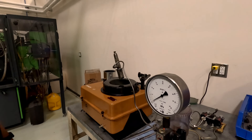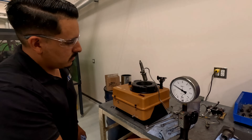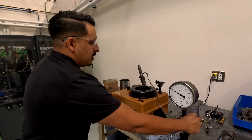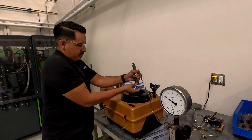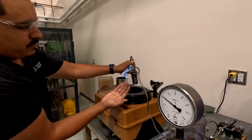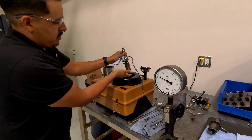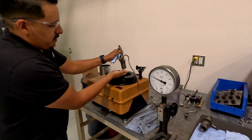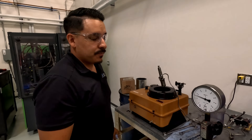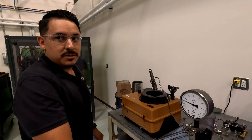That one actually sounds even better. That's about 105 bar. Here's the tell-all — as you can see right now, we're still dry, so we're good. No seeping on this injector either. The seat's probably pretty healthy, and that's a beautiful chatter on these indirects.